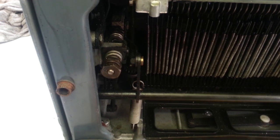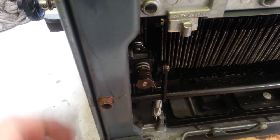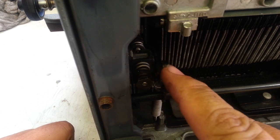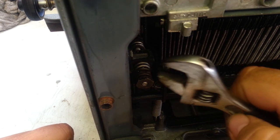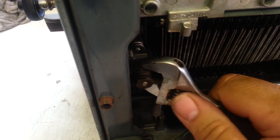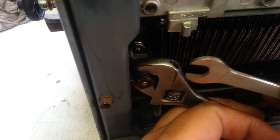I haven't done one of these in quite a while — let's see if we can get it. What we want to do is bring these two nuts inward, tighten them up on the threads maybe a half a turn. There's one, two, and then there's this little cushion spring. I'm going to use the crescent wrench on the back one and hold it in place, and then this one is 11 millimeters.